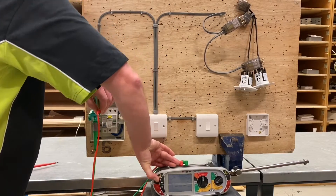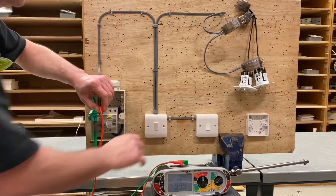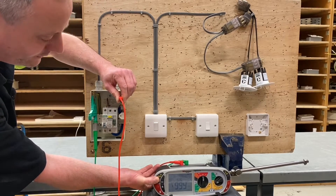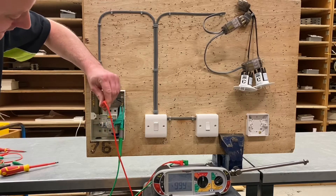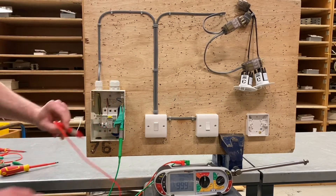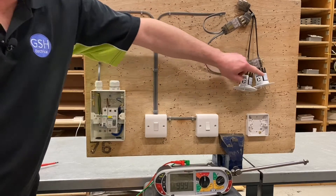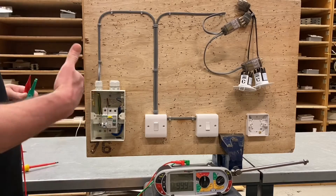I'll connect earth bar first, then the top of the breaker — firmly pressed — and press the test button. We get a reading greater than what the machine can measure: greater than 999 megaohms. Now taking the probe to the neutral bar, testing between earth and neutral bars — press and hold — again greater than 999 megaohms. Then onto the neutral bar and top of the line connection, press the test button — and that completes the first test. Remember: the breaker and RCCB stay in the off position; the RCCB has electronic components that could be affected by 500 volts, and the LED down lighters are disconnected for the same reason.